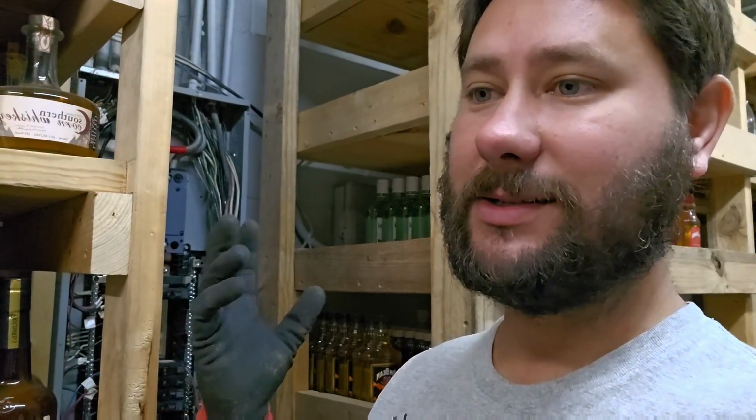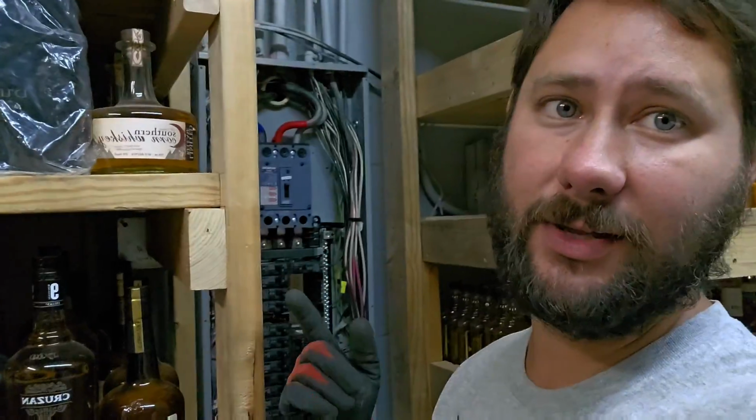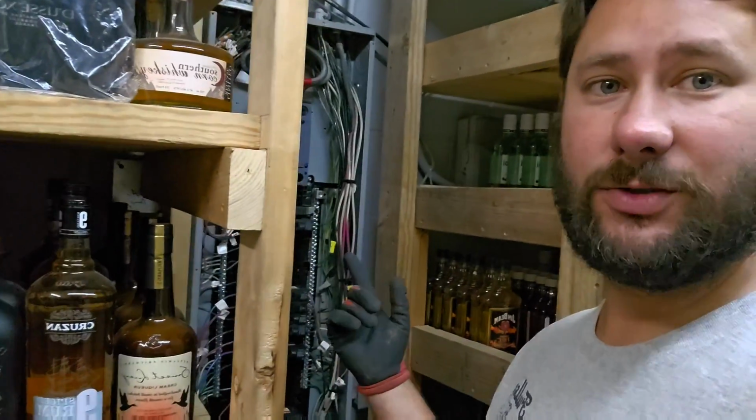I have never done this before, where I've swapped the 2 wires at the breaker, because with 230 volt, you would think that if it's single phase, which it is derived from the 3-phase though, so that may be where I'm having my issue. But I got a good ground. I just had to swap the 2 wires.